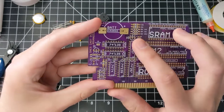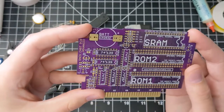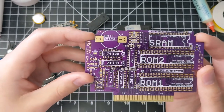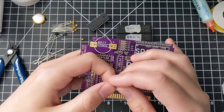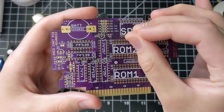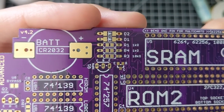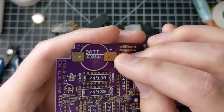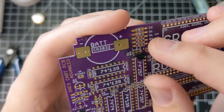Q1 and Q2 are transistors. I've specifically designed the board to work with 2N3904 transistors. If you use something other than those, you might get some save glitchiness or it might not save at all, so test it out if you're going to use something different. The 2N3904 is a very standard, inexpensive part. One thing you want to make sure about these parts: check the datasheet of wherever you get them from to make sure the pins line up correctly. You'll see on the board the pins are marked C, B, and E — collector, base, and emitter. Even if the shape matches the silkscreen, some 2N3904s will have a different order of pins, so make sure you get that correct.